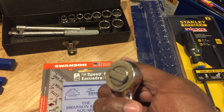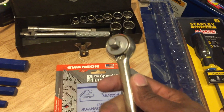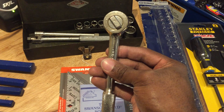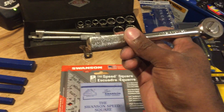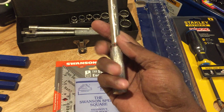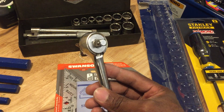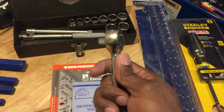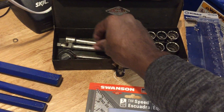I've cleaned it up — it sounds really good, nice and crisp. I put everything into an acid bath using muriatic acid and water to remove rust. The knurling was a little bit difficult but I got it as clean as I possibly could, and the ratchet works really nicely. It's a 3/8 drive, really good condition, and it cleaned up really nicely.